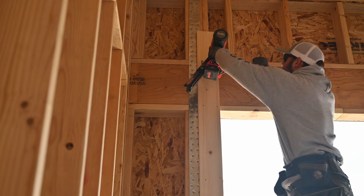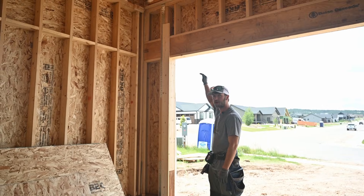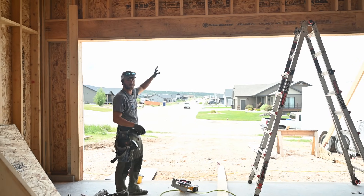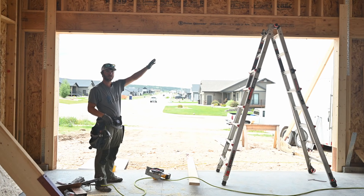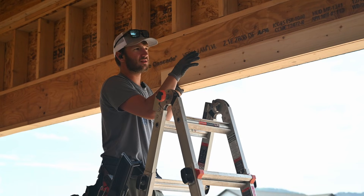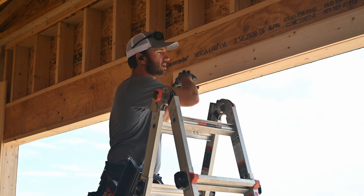So we got our sideboards cut. We had to notch it around this strap here and they run two feet past the bottom of the header. Now we're going to go ahead and put on this top board here, running inside to inside our two sideboards. Now we don't have a piece long enough here so I'm going to cut it right in the middle. Normally I like to do this in one piece — just a one 16-foot two by six — but since we're using one bys and we don't have them long, we're splicing it in the middle.